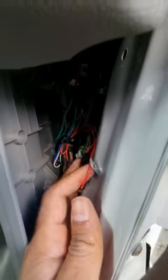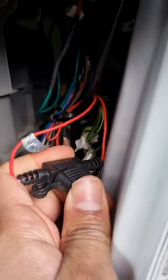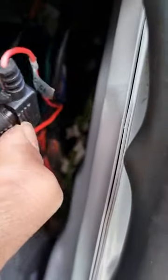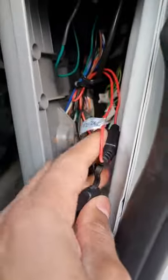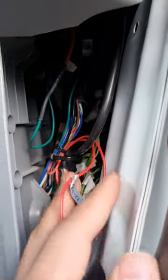As you can see over here, that's where your fuse is located. Remember, these cameras always have a fuse inline. If I pop this cover off, you can see it's a mini blade fuse — it's a 3 amp fuse. So that's the first thing you can check, and you can identify it by just following the wiring down on the top.